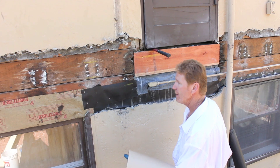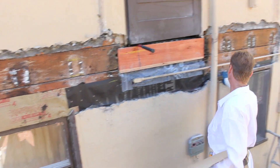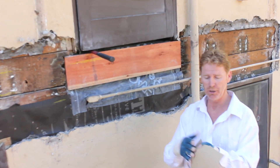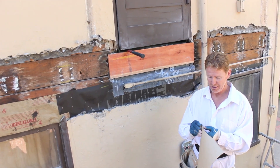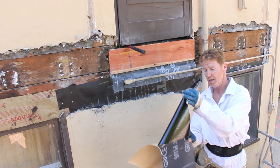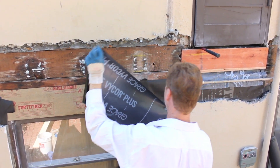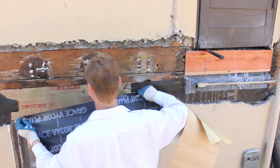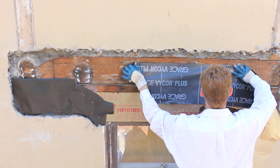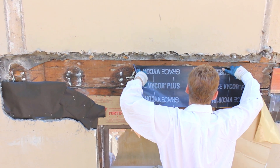Their ledger is going to go about right here. I used this grace membrane as an L flashing on this old window — it's an 80 year old house. Now I'm going to peel and stick this stuff. It does take a little bit of time to do but it's well worth it because it'll seal everything. I'm going to use that wood there as a template. If it was hot sun right now this stuff would stick to everything — it's a real drag to do it in the hot sun. Jay is holding the camera so I'm doing it by myself. You can see this stuff sticks to everything.